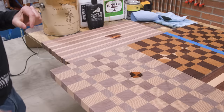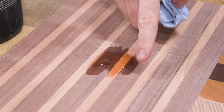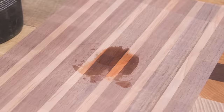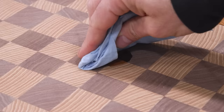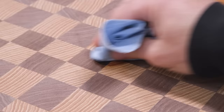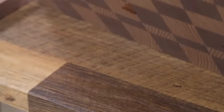It's actually been a full hour — an unexpected guest stopped by. Let's look at the controls first. You can see a good amount of water has soaked into the grain — after an hour, some absorption definitely occurred. Now the end grain control — I'd have expected it to absorb more, but you can see there's still plenty on the surface. Flipping it over — yep, it did soak all the way through the grain.